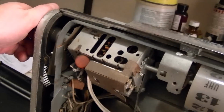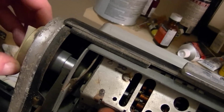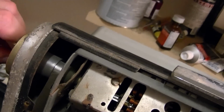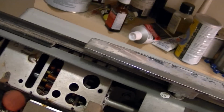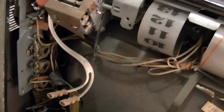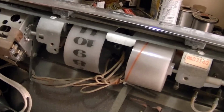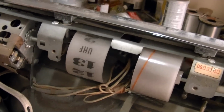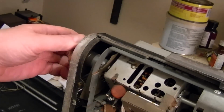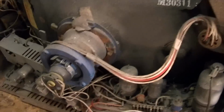I wonder if on the tuner you use the outer bit for fine tuning the UHF. These early UHF sets wouldn't have a channel clunker for the UHF, they would just have a continuously variable dial, and you would just put it on UHF, and then you would use this to tune around all through like 13 through 83 or whatever the UHF band is.